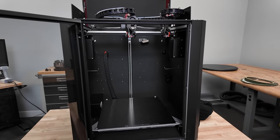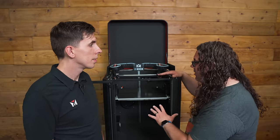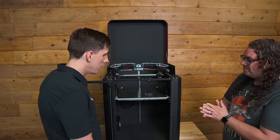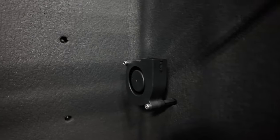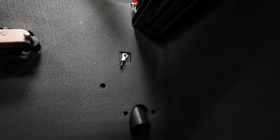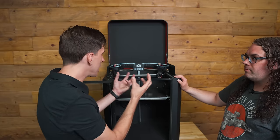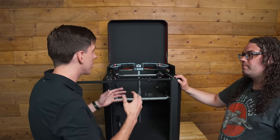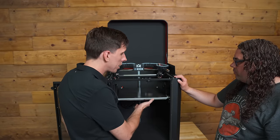Can you tell me about the inside of the chamber? You've got the chamber heated actively by the heater down here. It also has a circulating blower fan on the side, and two chamber temperature sensors that take the average — important because you get hot spots around the chamber. You want to make sure it's fully up to heat and staying even throughout.